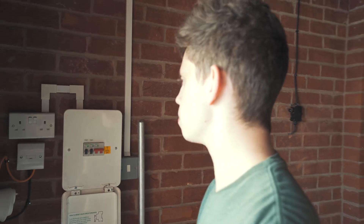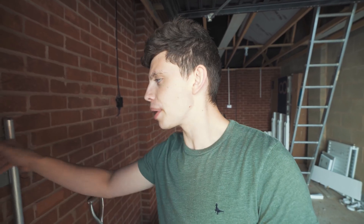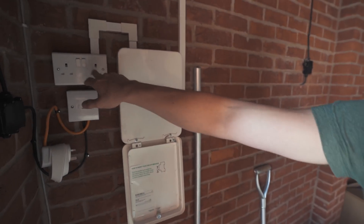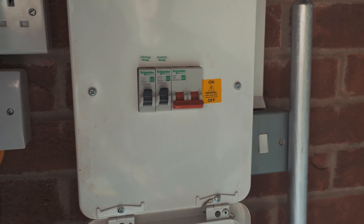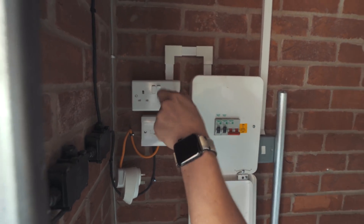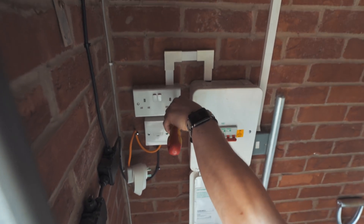Before installing any plug socket and messing around with the electronics — and by the way, if you are young, and I know a lot of our viewers are young, please do not go out and buy one of these and blow yourself up installing it. Seek professional installation advice or get an adult to do it. I just don't want you guys to hurt yourself. What I'm going to do is totally isolate this socket right here, so now there's no power going to it and I can go inside, take it fully off the wall and tamper with the electronics without risk of getting hurt.